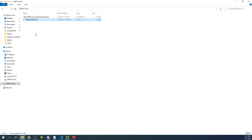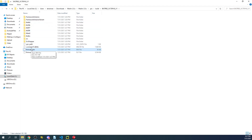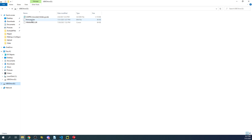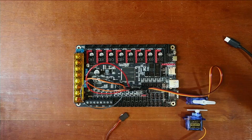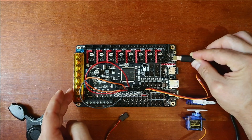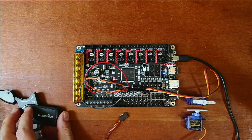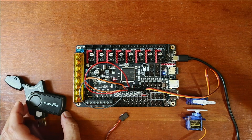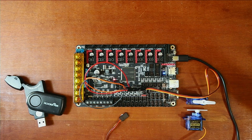The build finishes on firmware.bin. Right-click and select Reveal in File Explorer. The previous firmware.bin gets renamed in all capitals to .CUR — this is still a firmware binary file, just their way of noting it has changed. We send the new firmware.bin to the E drive. Back at the workbench, we pull out the drive we used, place it back into the board, and power it. The jumper is set to USB power so it will allow the firmware to load — though if you use certain steppers you may need to remove the USB jumper and run off direct power.